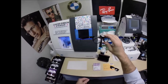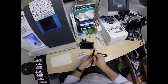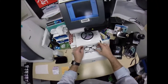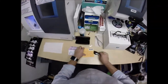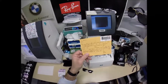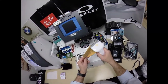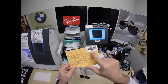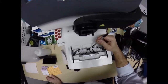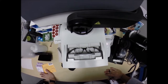Let me go ahead and begin by popping out the original demo lenses that come in the frame. I'm going to put the frame into the tracing element of my blocker, and I'm going to assign a barcode number to this frame. So years from now, should Sharon ever need new lenses, I can mail them right to her home. She is Secret Agent 3568. I'll hit the start button and the little stylus will trace the inside bevel of the right side of the frame, then do the same on the left.